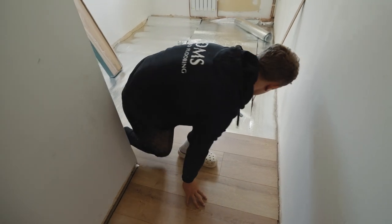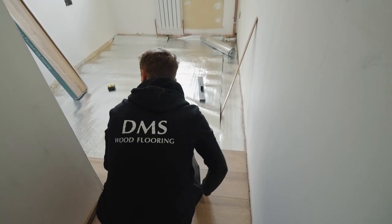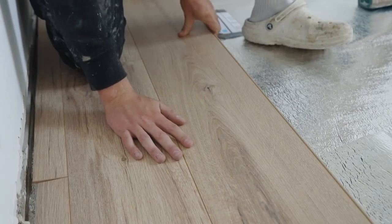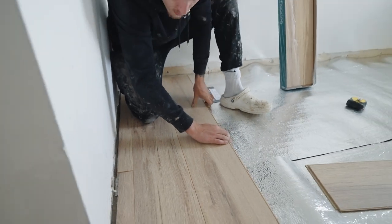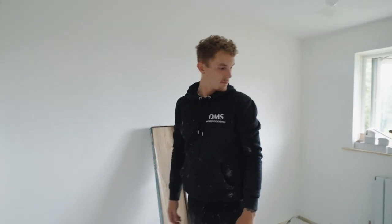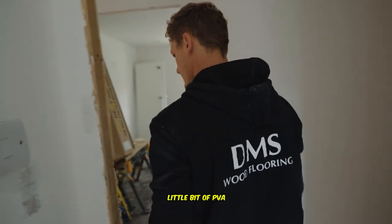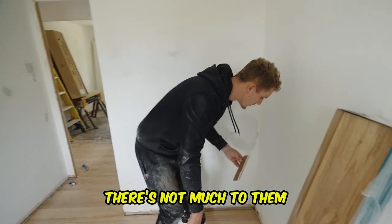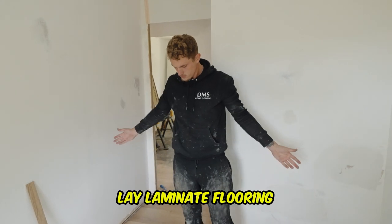Another tip for laying laminate: you always want to be on the floor really. It's easier to pull your boards in and push them in, so get a bit of pressure from here. Long length in, I sometimes give them a slide as well, because that just helps to groove out a bit. Push it up. Simple as that — and that's a row down. A little bit of PVA on these little joints, just because they can be a bit fluffy sometimes. There's not much to them. And that's pretty much how to lay laminate.